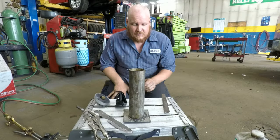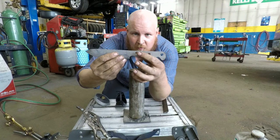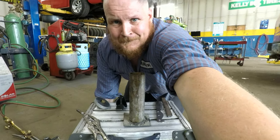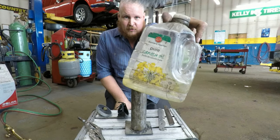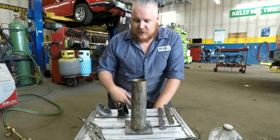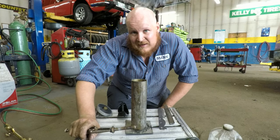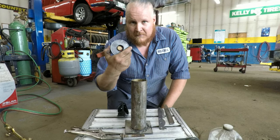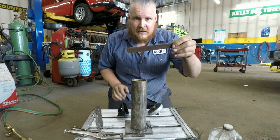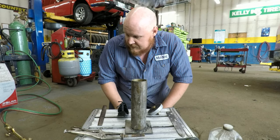So let's go heat treat this. I'm at my work and I've got the knife right here. I did end up drilling the holes out for my handle — these are 3/8 holes because I'm going to be using 3/8 brake line as my pins. Very, very simple. I just use some canola oil — it's what I've always used. O1 tool steel is really, really easy to work with, so it's kind of hard to mess it up. I get a bolt red hot and put it in the oil to warm it up a little bit. You're also going to want a magnet — you're trying to get to a point where the knife does not stick to the magnet. And then you need a file just to check the hardness of your heat treat afterwards.